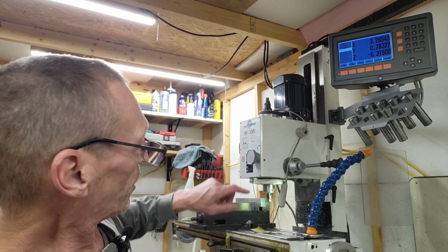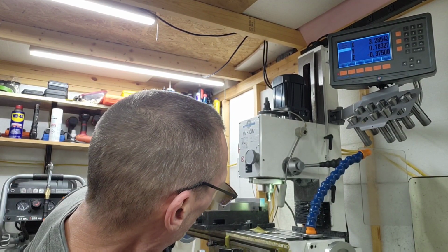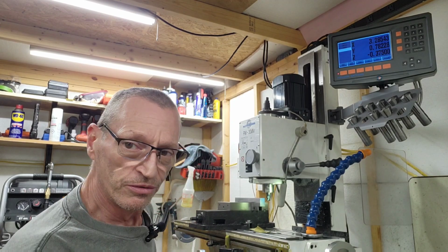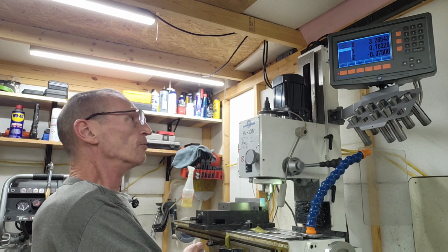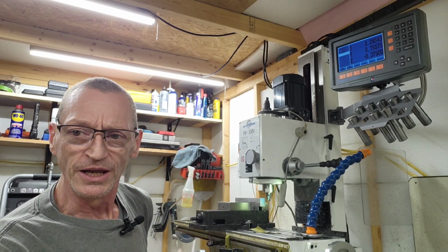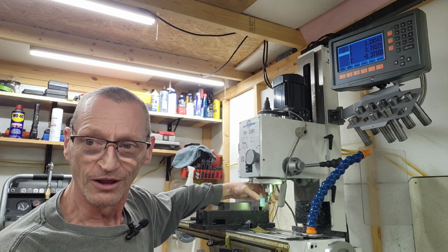So here we are. So we got our depth now. Our depth is going to be dead perfect. And we already know half of our 832 is 416. So I'll do 1 or 2 passes till we hit our finished number. So we're going to come in to 430 or 416. We'll do it to the 832 number, but this actually measures 830. I'm 2/1000 small.